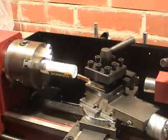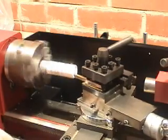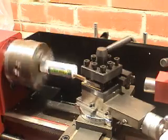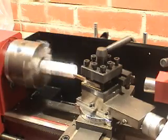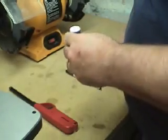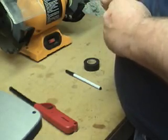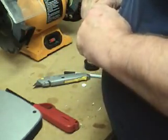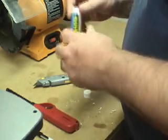We've chucked the little bottle up in the metal lathe there to make it a little easier. We'll score it most of the way through and then finish it up with a utility knife. We can get almost all the way through with the lathe, then take the utility knife and work our way through the rest. Once we've got a hole in it, clean it up with the X-Acto. Now that we've got that done, that's the combustion chamber.